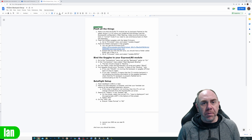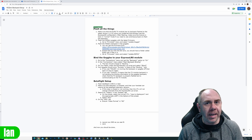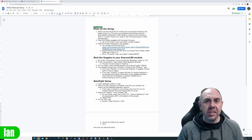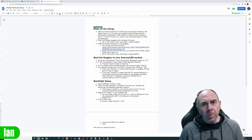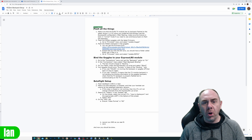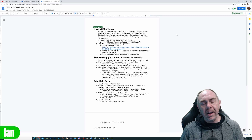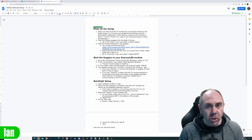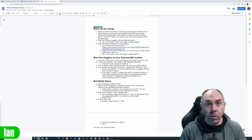The next thing we need to do is update the backpack firmware on the HD Zero goggles. They have that ESP32 backpack functionality for ExpressLRS built in, but it actually uses a separate firmware from the main goggles firmware. I will put a link in the description of this video where you can download this. There is a document included showing you what to do — you take the file linked in that document, place it on an SD card, and then we'll update the firmware on the goggles and walk through that process.